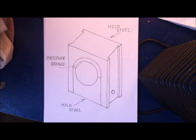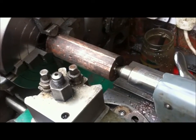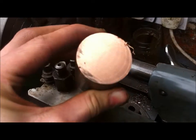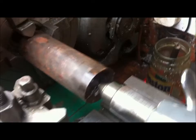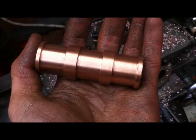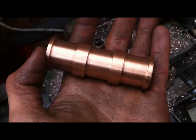We start over at the lathe where I'm machining what I'm going to call half-shell bearings. I'm here at the Myford lathe, just about to turn the half-shell bits of bronze. To save on material and machining time, I started with a full round, chopped it in two, machined each side so they were the same thickness, and then soft-soldered them together. I've now turned all three pairs together — so there are three pairs of what will be half bearings. Now I can cut down these two lines and warm them up to separate them into six parts.